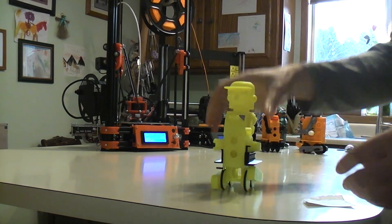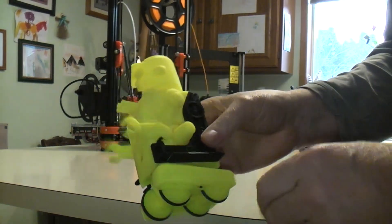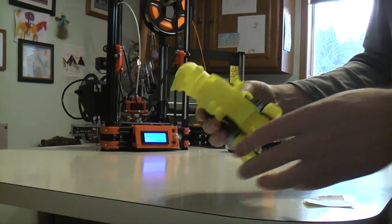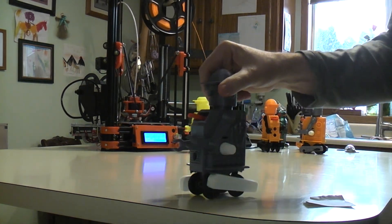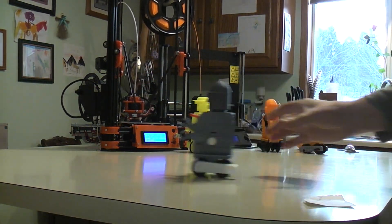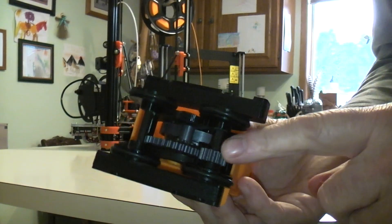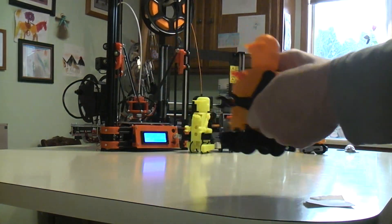This was the first prototype. When I'm doing my prototypes, I don't really care what color plastic I use because I'm just testing the workings. You can see it works but not great. Based off of that, I went to a second version in which I increased the spring width about 20%, and you can see that made a big difference — it had a lot more movement. Then I decided I could get even more traction if I changed the rear gear ratio, so I put on a larger gear which actually slows down the drive wheel but gives it more drive.